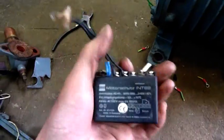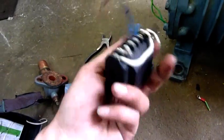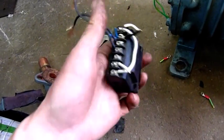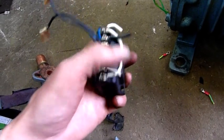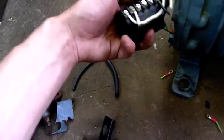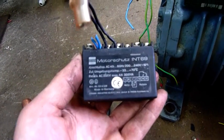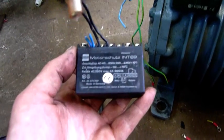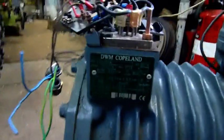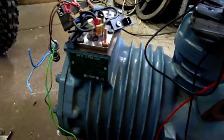There's also a temperature switch in there — I'm guessing it's a thermal cutout, probably sends a signal back to the control to say shut down when it gets too hot. It also has two neutral wires coming off for the fans. The motor protection is an INT 69 — this is all made in Germany by the way.